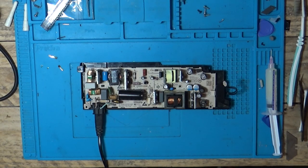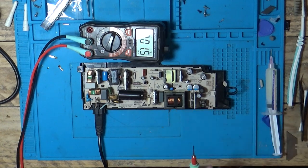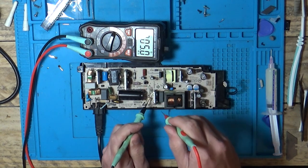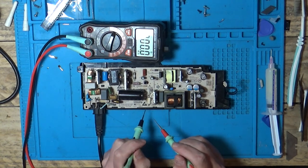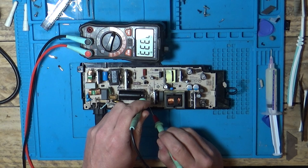Before, we were showing a short between pins 2 and 4 — we have nothing now. The diode down here that was shorting is now reading 0.6 in diode mode — that is now a normal diode reading. Let's get this back together and watch it go bang. Right, now we're going to put the plug in the socket — let's see what happens. Nothing so far — it's good. Let's check our voltages again. We have our five volts over there. We've got 334 volts through there.